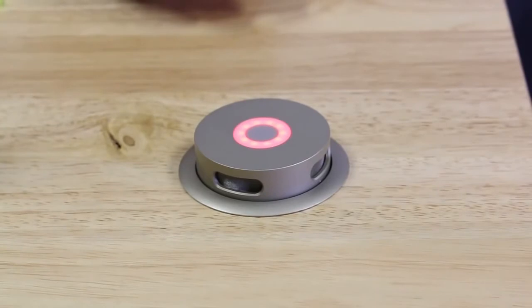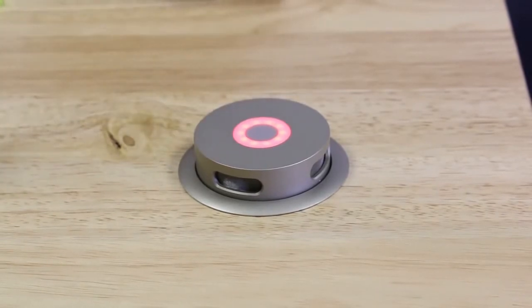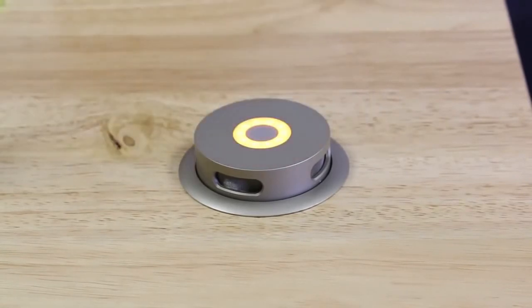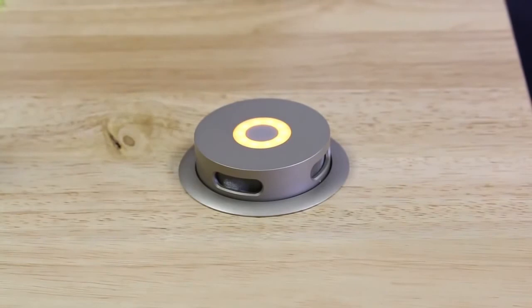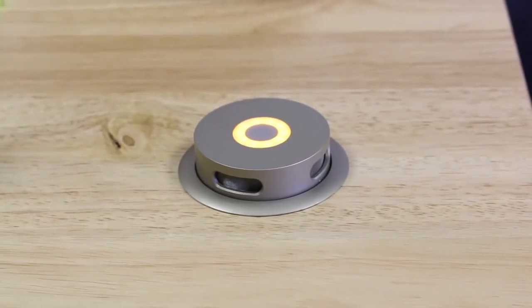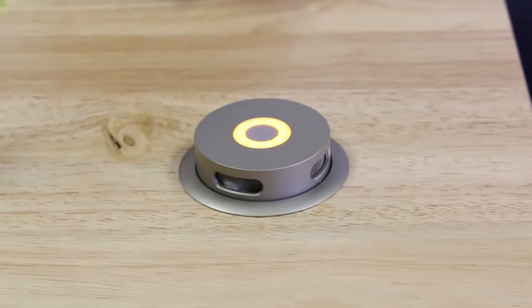In this case, we've programmed the logic in the DSP to give us red, which means it's muted, or we're changing it to amber by lighting both rings. An application here might be amber could indicate a hard mute that says the chairman is not able to unmute this microphone even if he unmutes everybody else's.